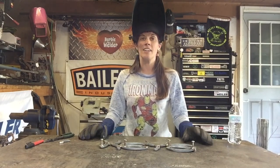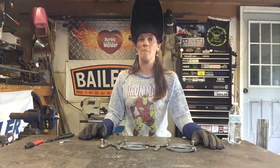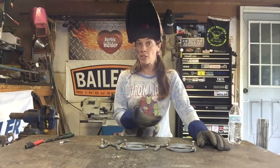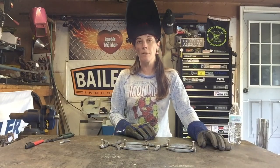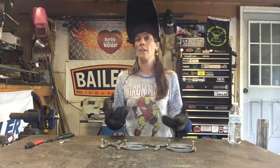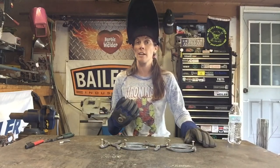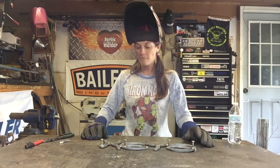Go ahead and get your project cleaned up. When you're finished with that, I personally use a clear coat. It's a rattle can of Rust-Oleum clear coat. I spray once it's cooled off. I spray a couple of layers on it, let the first dry a little bit, and then put a second layer on. I like it because it keeps it from rusting and gives the metal a nice patina. You can also let it rust. It looks cool like that too. That's my personal preference. Again, art is subjective. You make your project what you want, which makes it a lot more fun that way.